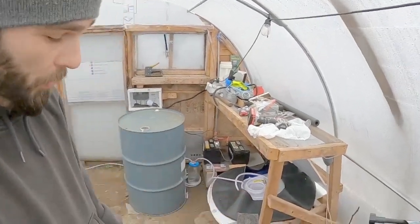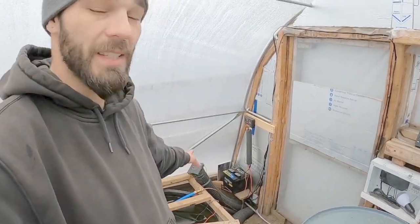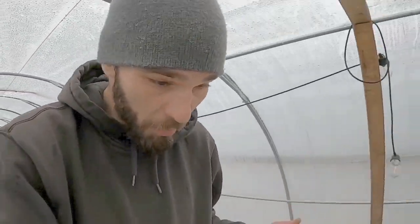I'm very thankful to have my geothermal running and my compost heater, because if I didn't and was only trying to run water through here, we might not get such good results. We're sitting about 55 degrees in the greenhouse right now, and it's like 29 to 30 degrees outside with no solar activity. Before we started compost heating and before we put the second layer on, one single layer of poly was holding about maybe 10 degrees above the outside ambient temp. Now we're sitting 20 to 25 degrees above the ambient outside temp with no sun.